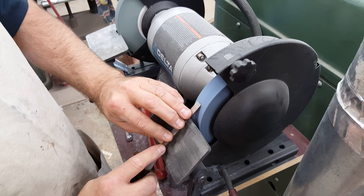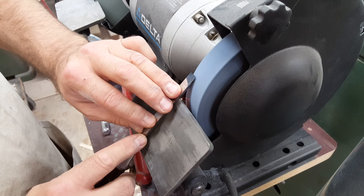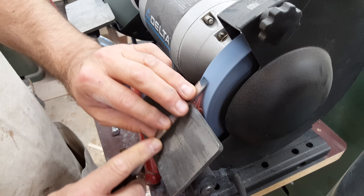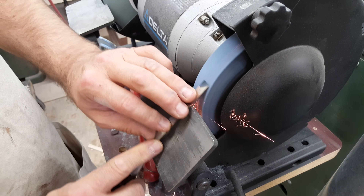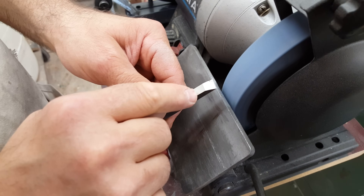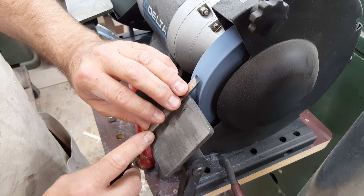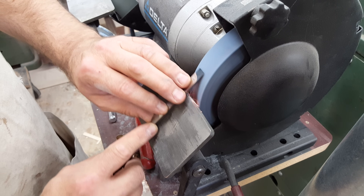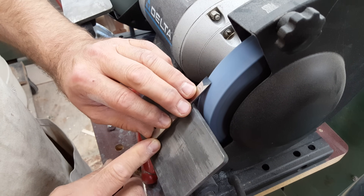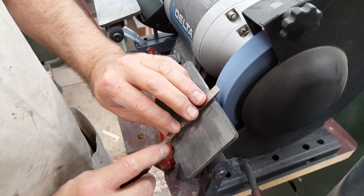There's where I'm working, right here. It's about time for a new wheel — I can't get the tool rest any closer than I am. The back of this chisel has already been done, as you can see from the polish. I just keep checking this crest line right there to see if I'm keeping it square. And I keep my fingers up close to the end, so if it's getting too hot I can tell, and that'll give me a chance to cool it off.